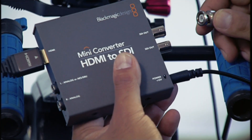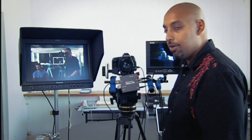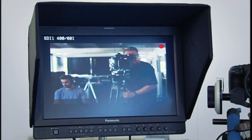So I'm going to put this box back together and see what kind of output we're getting on our 5D now. Now that we've downgraded the firmware in the converter box, we've hooked it back up to the Canon 5D, and as you know, when we're in standby mode we're still in HD, but now this time when we roll and it changes to SD, let's see if the image will come back. Success! Because of the firmware downgrade from 1.5 to 1.4, we can see an image on the screen when the camera is rolling.